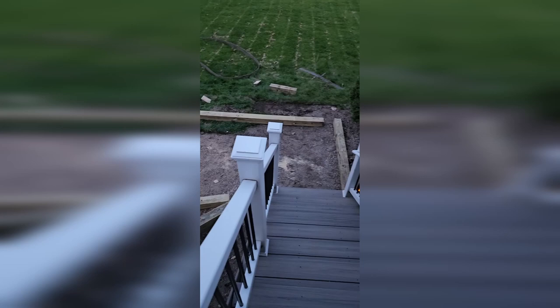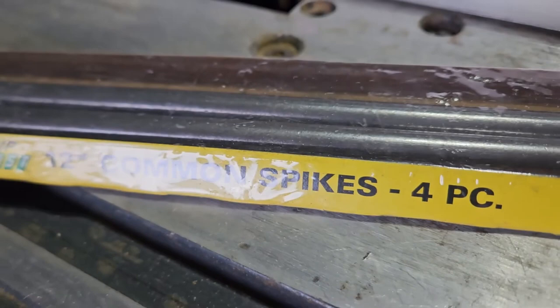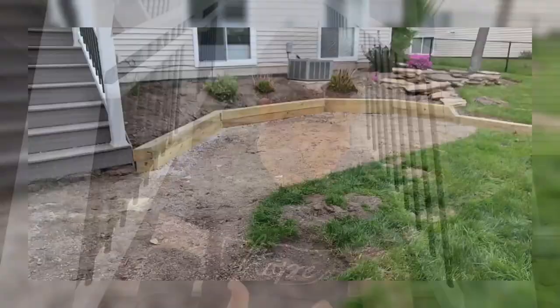The joints are not perfect — actually nothing out here is perfect, and that's okay. When I was putting the beams down I had to stake them to the ground. Some videos recommend putting in rebar; I ended up getting ground stakes about a foot long, drilled into the beams, and pounded the stakes in the rest of the way with a hammer. I cut pretty much all of them at a 45-degree angle to make the corner, using a circular saw — I could only cut halfway and then had to flip it over and cut the other half. The angle isn't incredibly accurate, but it ended up looking kind of cool.